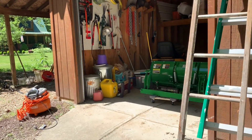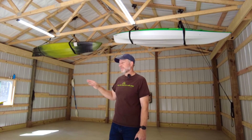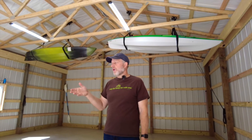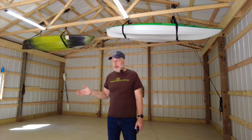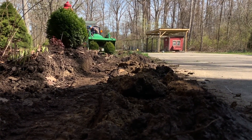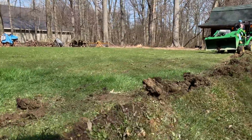The three main options I see: if that shed is going to stay, I can probably tap into that underground Romex and run another 50 feet over here. It's kind of lengthy — probably about 170 feet of 12-gauge Romex back to the house — so I definitely would not want to hook up anything with high amperage or high wattage. But for lights and a few other items, it might be just fine. If I wanted a workshop with table saws needing 220, I'd have to trench all the way back to the house and possibly add a sub-panel or a whole new meter.